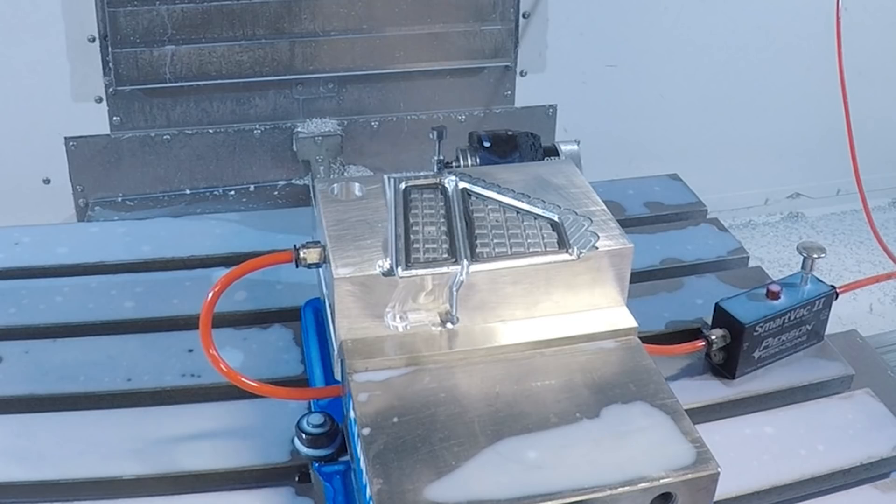Here's another great example — just a photo of a part I saw once where they had a really cool custom op 2 hybrid fixture. It's a vacuum fixture machined into a block of aluminum with a number of locating features to hold a pretty complicated tapered, angled part for a final operation. You can see the vacuum port coming in on the left side, a honeycomb pattern to allow vacuum airflow, two different gasket sections, a tapered wall on the front face, and locating features on the top side.